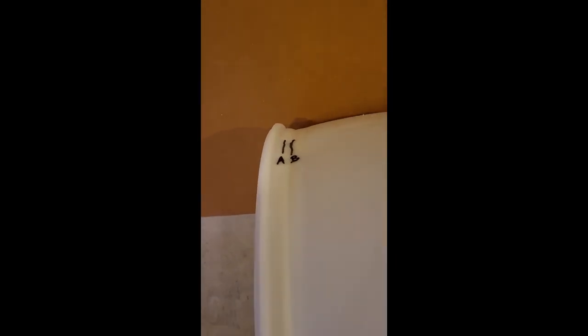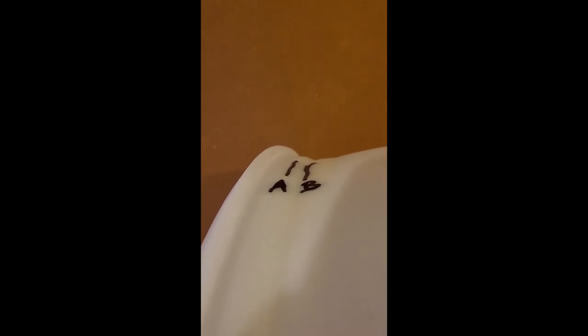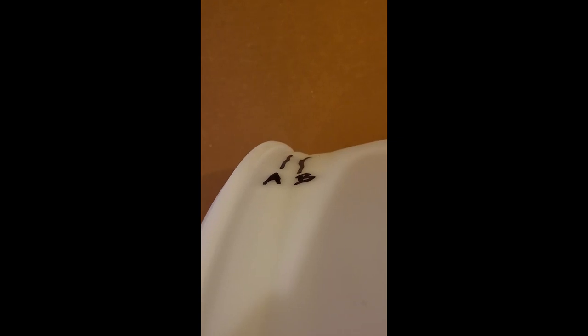As I look at this drum, I noticed there's a step down from the lid where it transitions to the body of the barrel. Looking at line A versus line B, I think line A is bigger in circumference than line B by at least the thickness of the plastic in the drum. So I think if I cut the lid off at line A and then cut that flange off at line B, the lid will slip right down over the top of the drum.